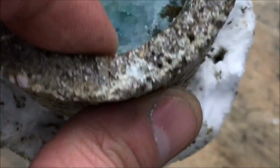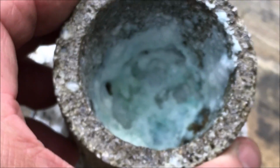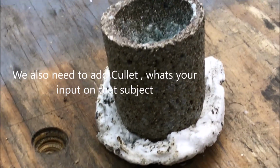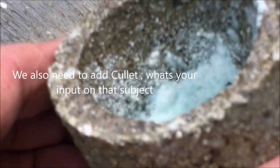I'm thinking we try this again with a better crucible, one that isn't so thick and that isn't made of this garbage here. Well, it's not garbage, it's only rated for 2,700 degrees. So that's proof that we're well over 2,700 degrees. I think we should try it again on diesel for 4 hours and see if we get actual melted liquid before we go to propane. But I almost just want to switch to propane right now and get it over with. But I'm looking for the long haul here, you know. You guys are going to have to buy propane tanks, all that stuff.